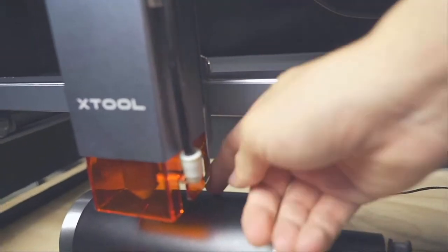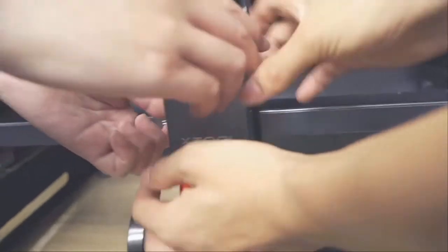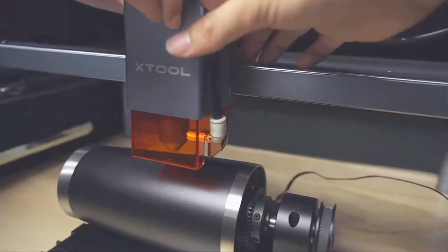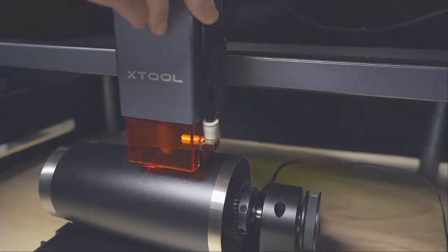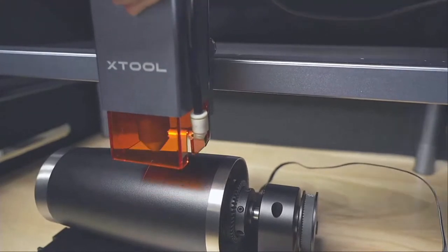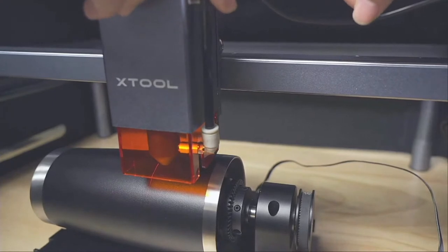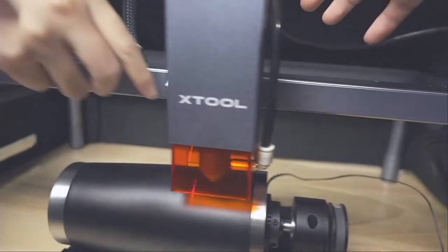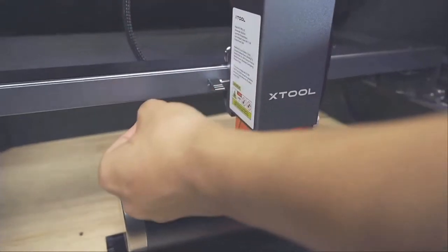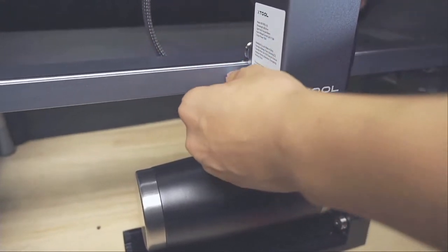I don't know if you remember, this is the ranging rod, or you can call it setting bar. Always make sure the tip of the setting bar touches the top, the highest point of this tumbler. Clearly now it's not touching it, so I need to adjust the toggle tag. Make sure it touches the top of the tumbler, and we need to tighten it. Remember, put it up first, put it out first, and put it in again, and rotate it, okay?